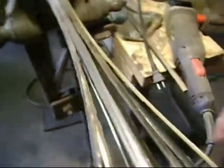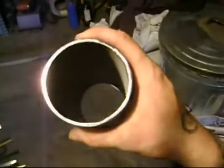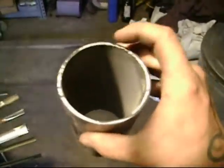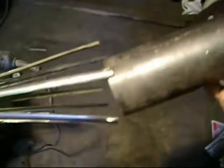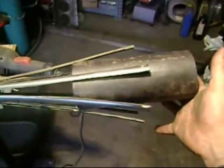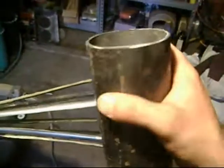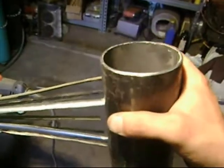What I'm going to be putting in there to hold the reservoir for the fuel is this: seven inches long, three inch diameter pipe, eighth inch thick — I don't know what schedule that is, I can't remember. But basically that's going to fit all the way inside there, and this is what's going to hold the canister that holds all your fuel.